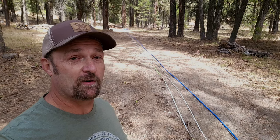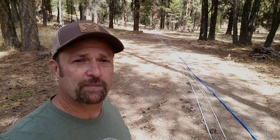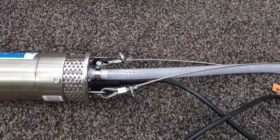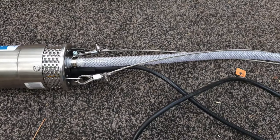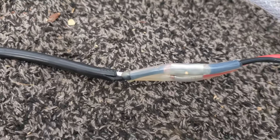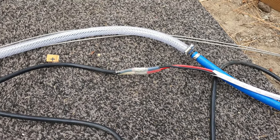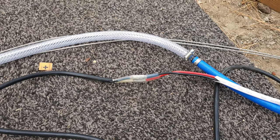Okay, we've got everything laid out. What we have here on the ground next to the measuring tape is our half-inch PEX pipe, our eighth-inch safety cable, and our electrical cable. That electrical cable is 12-2 marine-grade wire for water applications — 12 AWG is what you're looking for. We're now going to go ahead and make all the connections to the pump. Before I wrap everything in black tape, let me show you the connections on the pump. We've got our safety cables, our nylon hose, and over here is our electrical connection — you can actually see the glue coming out of the ends. There was enough in that pack to do this twice. On that step, make sure you put the heat shrink on before you make your connections — save yourself some headache.